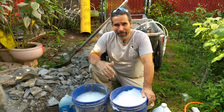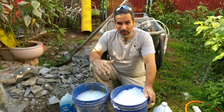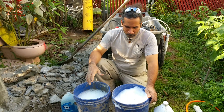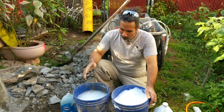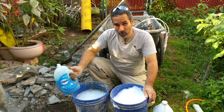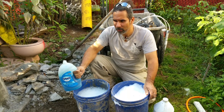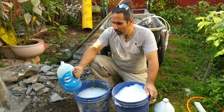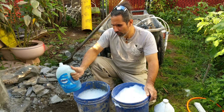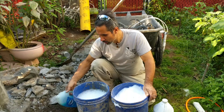This is Harry and today I was doing a bunch of experiments with the air crete, using different foam solutions. I'll be posting those videos later, but I've come to a conclusion: any dish detergent, whether it's Dawn or Seventh Generation, you shouldn't use as a foaming agent because they have other chemicals in there that are for cleaning.